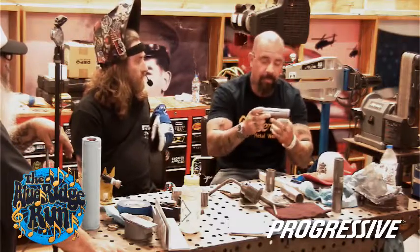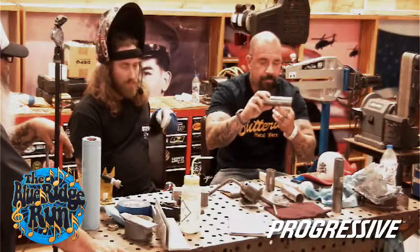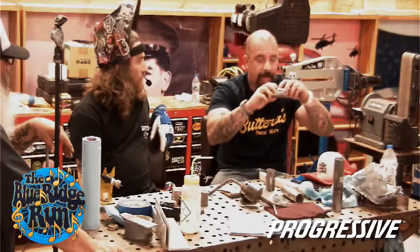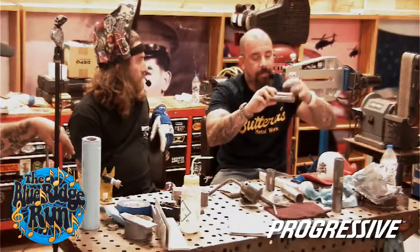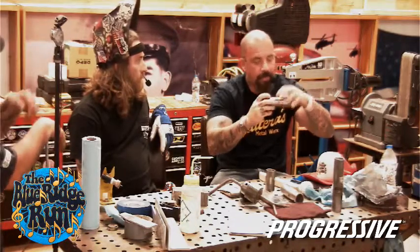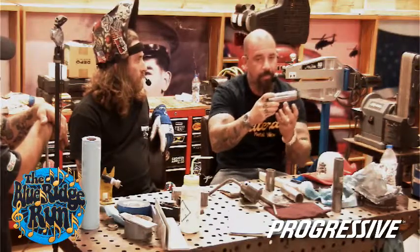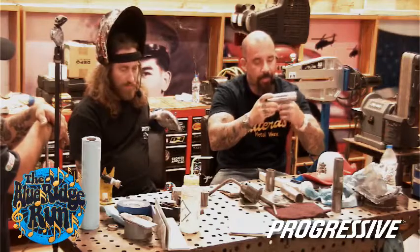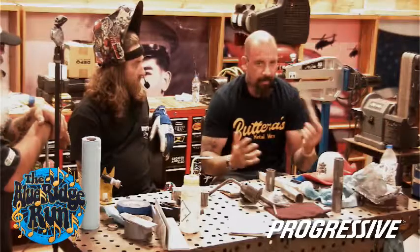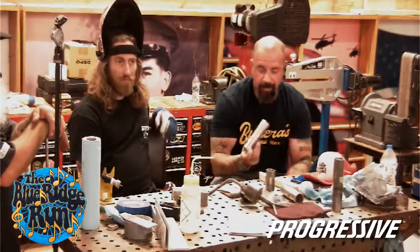If it needs that gap, I'll even stitch weld the bottom. I'll use a trick like a piece of filler rod wire or whatever it is in that gap, and then I'll tack and close in on each side of it, where it's almost locked in place. Let it cool, and then I'll follow my same weld procedure, but in a way that I want it to pull a certain way. So if I'm going to weld here, I know it's going to manipulate it that way, let it cool. So it comes back to learning metal and what it does, but the order of operation is important.